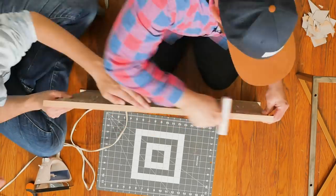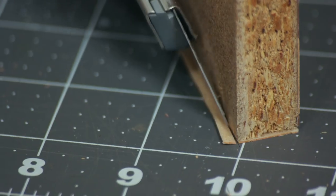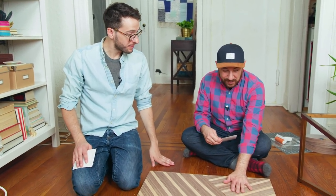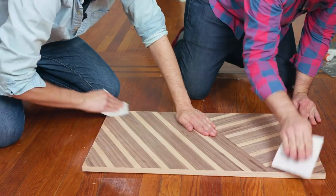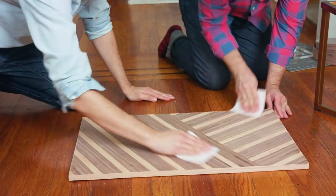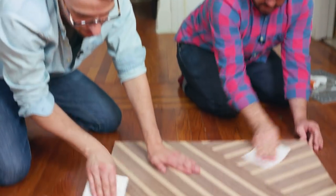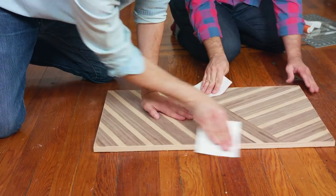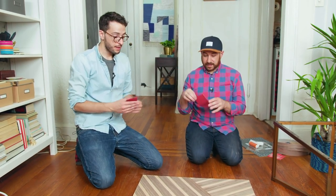Now we do the opposite side. So now we're going to cut the extra pieces just on the bottom — just the sides and the bottom. It is finished — I couldn't be happier. This looks incredible, it looks beautiful. Now we're going to sand it, and from what we found out online, you really don't need to be delicate when you're sanding. Sand with the grain, but don't feel like it's fragile — you really want to make sure you get all those splinters off. I'm starting with a 100 grit, which is a rougher sandpaper, and then we're going to work our way up to a finer sandpaper. For the edges, we can go at a little bit of a diagonal just to clean up the tips and that line. Now we're going to go up to a 220 grit and do it again.